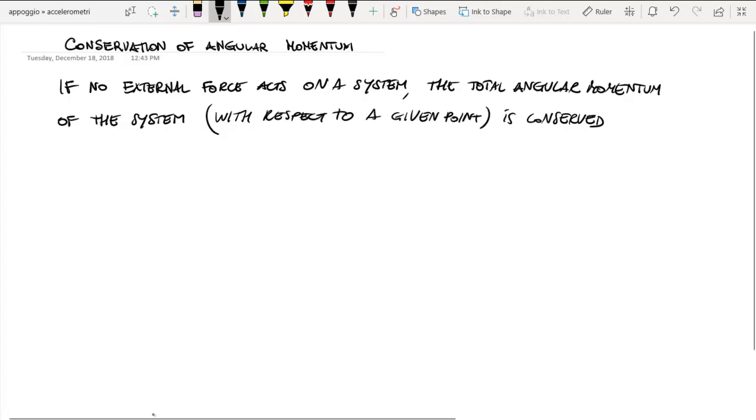And indeed, the first gyroscopes were based on a rotating mass. If you want to simplify things, then you can put a mass in vibration, which is what we do in the case of MEMS gyroscopes. So a mass, which is again attached to the plate of a capacitance, is put in vibration. When it is put in vibration, it has some angular momentum, and then we're using the conservation of this angular momentum.